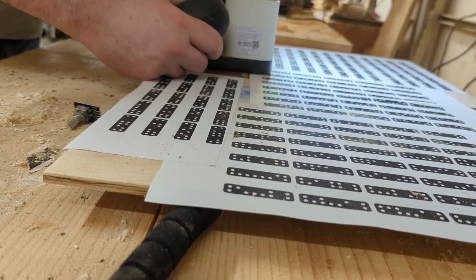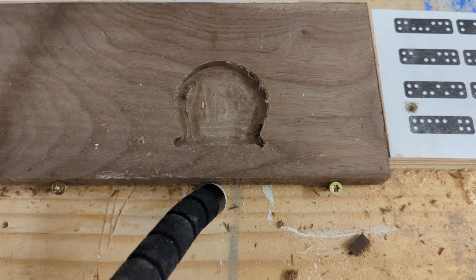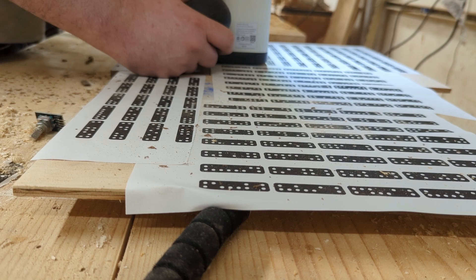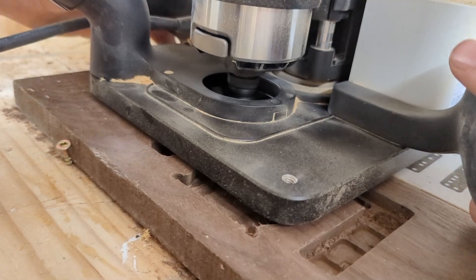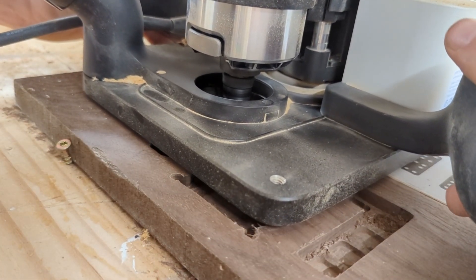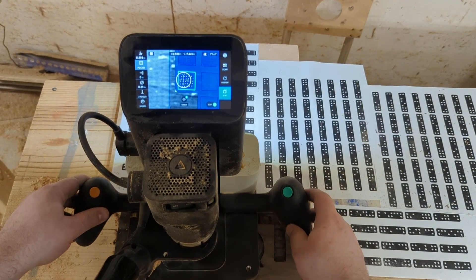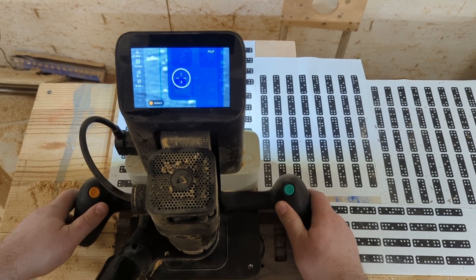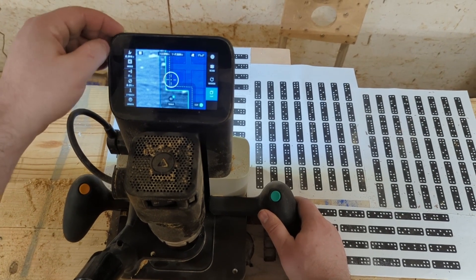This is me cutting out chunks of the board — my first cuts on this project. I have some screws in to anchor it down, which is really important because if it moves, you ruin the piece. I'm cutting out a couple of inserts where the keys are going to go. You have to go through and do cleanup with hand tools, because having a CNC doesn't mean it does everything for you. I pushed the button and I'm hogging out the little squares where each of the keys will go, following on the screen and it corrects for any mistakes I made.